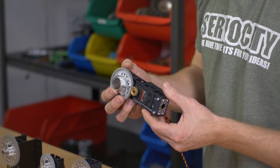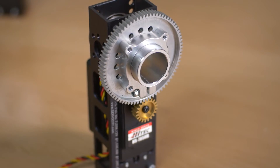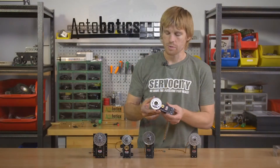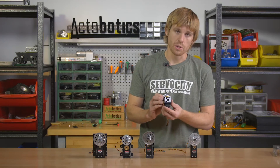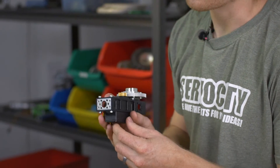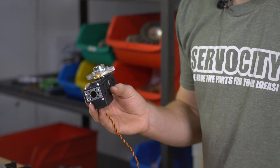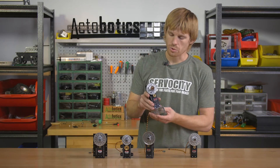The next version is also going to be a tube gearbox, but this one has a 1 inch hollow shaft going through it. Same height, same width in every way, but if you want to run some wires or basically whatever you need through the center hole you can do that without getting it tangled, and it makes for a nice clean build. I went ahead and put an end cap on this one — you'll find it has 4 tapped holes and 6 through holes, so you can attach it to any part of the channel wherever you want and it'll bolt right down.